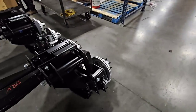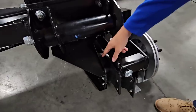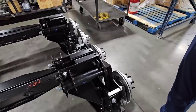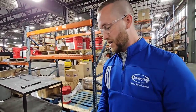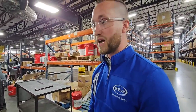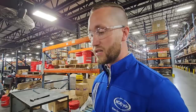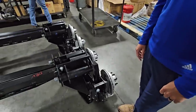So the key is exactly what you pointed to. Our rubber shear springs that you see down inside of here are technically two different pieces bolted together, offset, and they're moving in a shearing motion — moving up and down just like this. This is the same technology that we came out with and patented back in 1966. We're using the same technology today because it's some of the best performance in the market. Shearing forces are a lot different than compression.